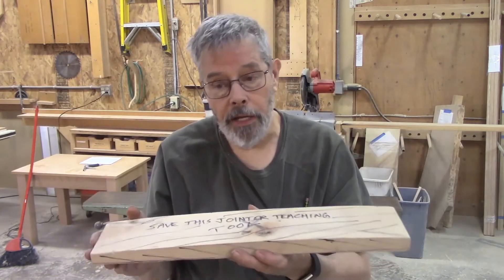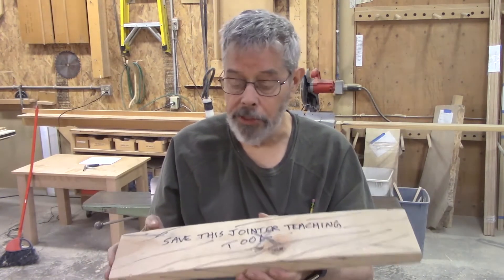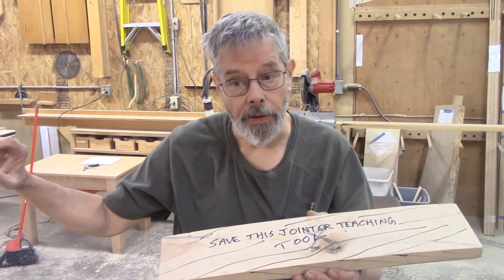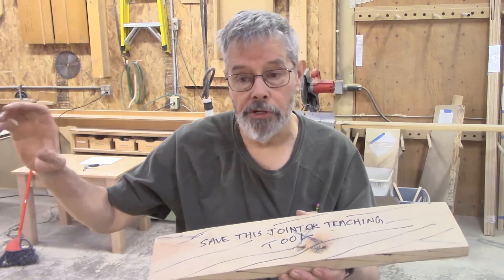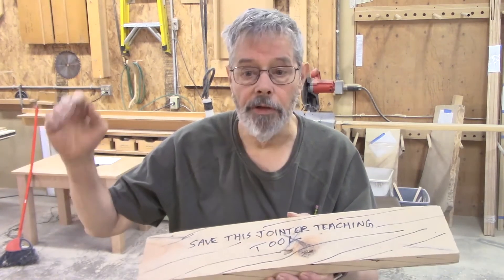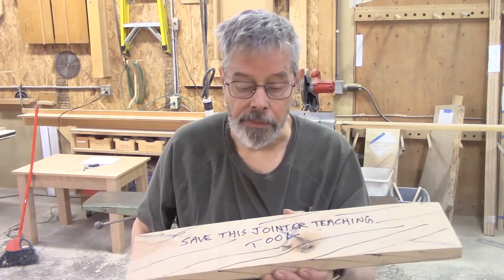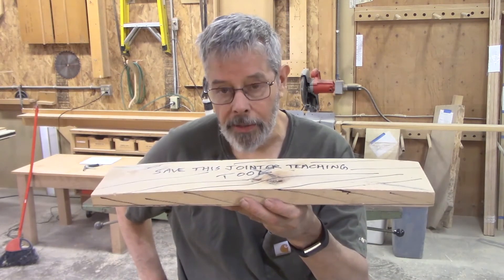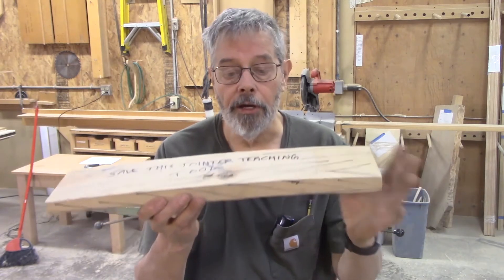If you're talking about an 8-foot board or a 10-foot board, it's almost never going to contain a straight three-quarter inch board if it starts off at one inch, which is what lumber starts off at — regular inches, with exceptions. They don't try to make it flat, because they don't know how long you want it. We buy it thicker, we cut it shorter.